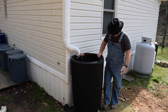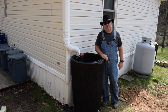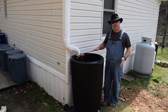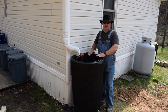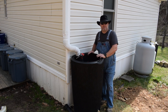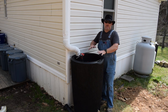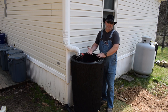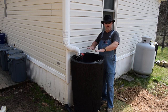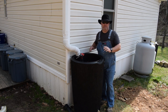Just like that, we got a rain barrel installed. All I've got to do now is get my garden hoses hooked up and run down to the creek. The one on the other side is going to be exactly the same. That one's going to take a little more leveling because the yard is sloped more away from the house — we're going to set it up on blocks. Leveling is a pretty important thing with rain barrels: if they're filled up and tilted, the center of gravity shifts and there's a possibility it could fall over, break the barrel, or just make a big mess.